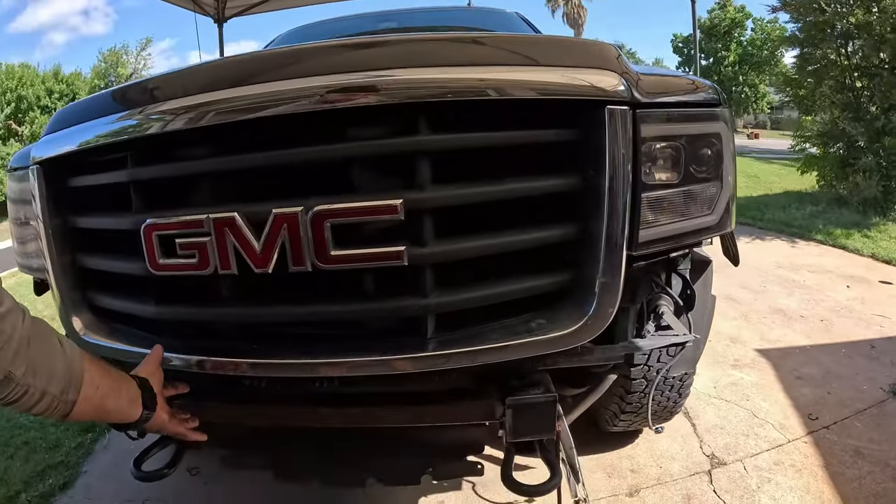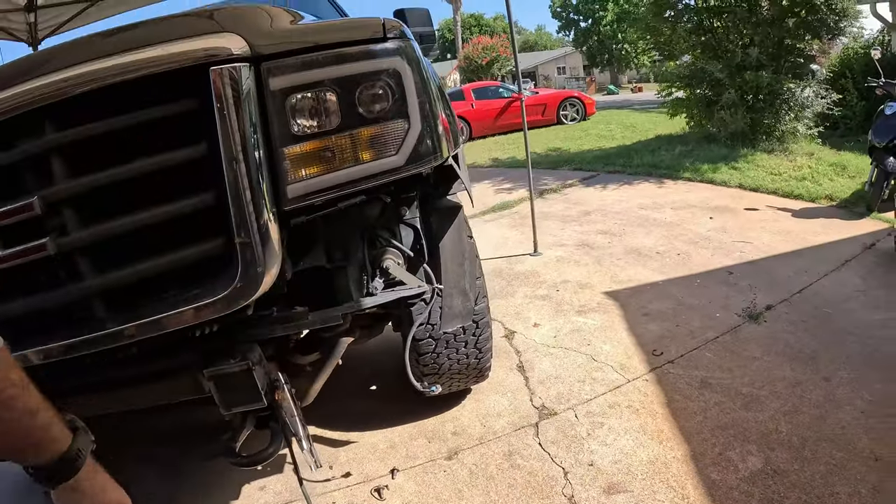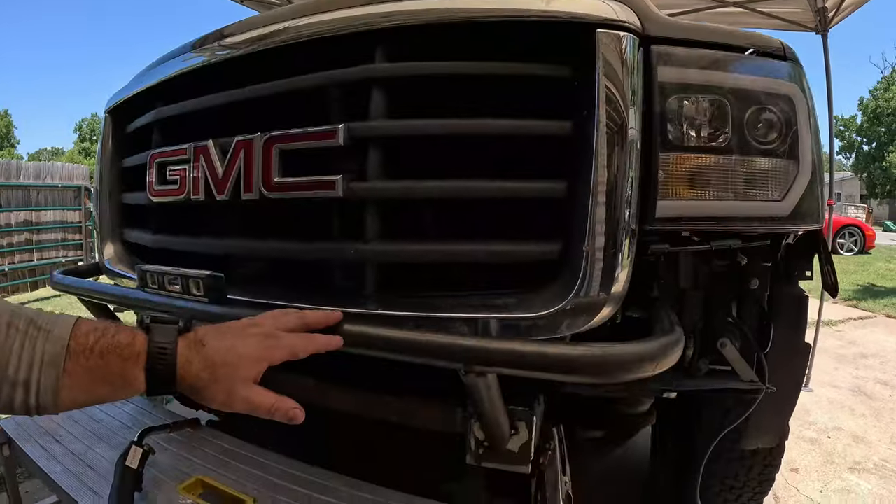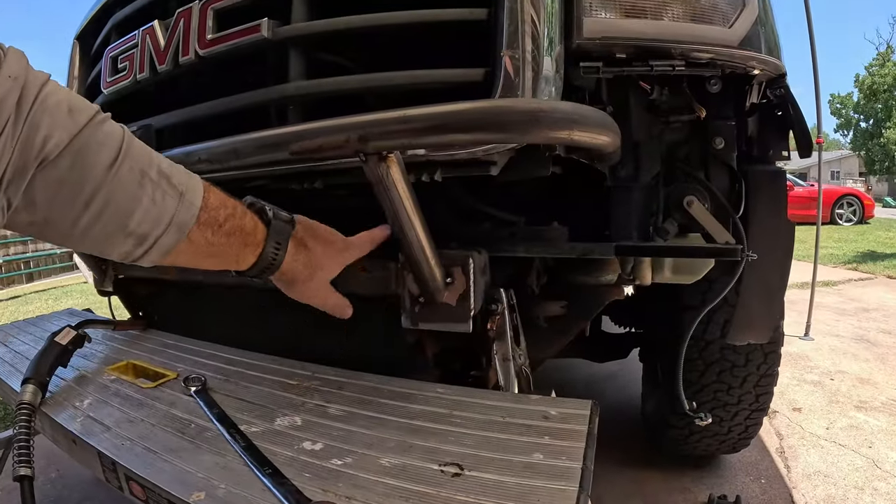The design is going to end up being about a 45-inch front. There'll be a front bar that runs parallel, then curves in and falls into this pocket, and then we'll build the sides off of it. The first thing I'm going to do is bend the actual bar, then figure out how to secure it down to the frame horns and exactly where we want it. I'm cutting the ends a little long so we can trim them back.